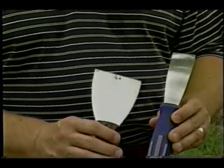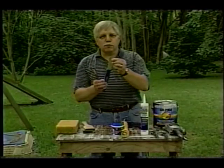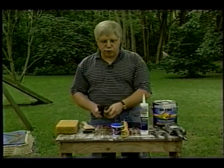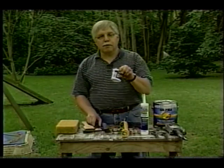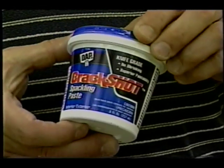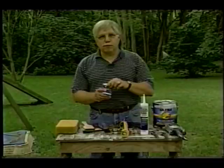The next thing you'll probably have to do is fill some cracked areas or nail holes. Putty knives — you have to have them. They're flexible and they work really well. Use the smaller ones for smaller holes and the big knives for the big cracks and areas that you need to fill. You'll also need spackling compound — make sure you read the label, as they make them for both interior and exterior. Get an exterior one for exterior paint jobs.